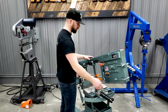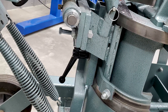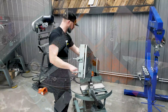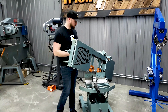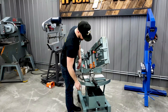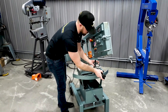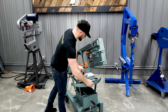The mitering features on the saw are 45 degrees in both directions. There's a little handle down here that you loosen up, and you can pivot the saw around. There's a nice gauge on the backside where you can judge your angle and get exactly set where you need to. It'll go in both directions, which is really handy — you don't have to move the material to cut a piece off at two different angles. You can just move the saw head, and the vise can be moved by loosening the little knob underneath, sliding the vise over to the other side if you're mitering in that direction.